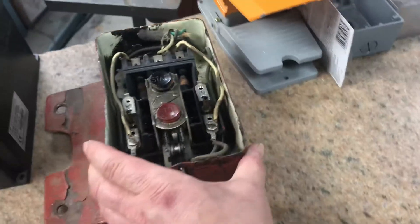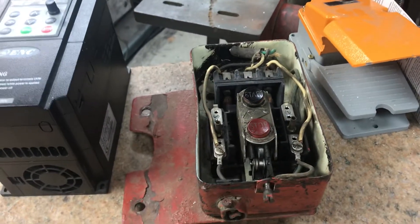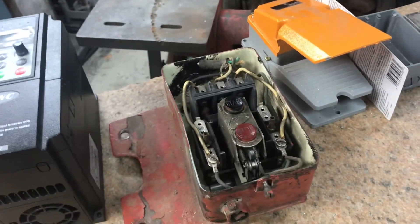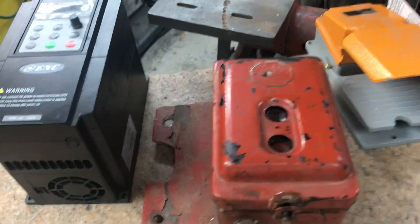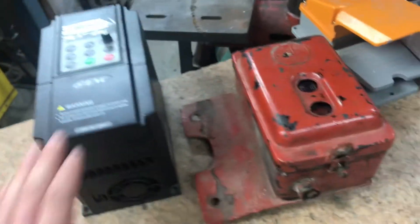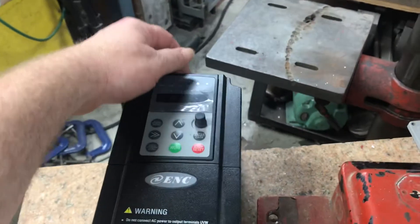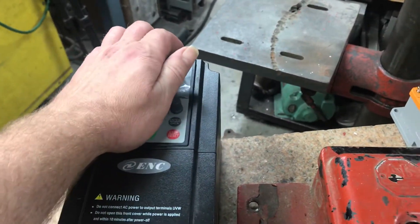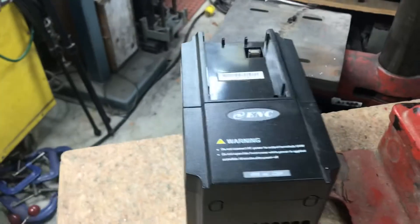For future use I'm just going to be using it for low voltage to transmit a signal to the VFD. I'm also going to be popping out the display and remotely mounting it. I'll get to that in a second, but the VFD needs to be inside a metal box.